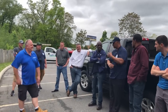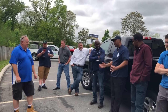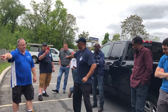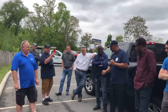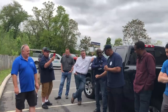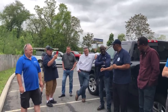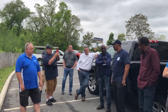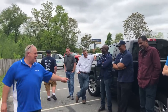I did this one lady, just a small section. Her whole deck, you walk on it, you might as well just slide. Sodium metasilicate. And I just took some of it off with my M5. Took it all off, but then you can see the spots of the mildew. That's where the spore started. And that's really gross. Sodium metasilicate, get it out of here. Just putting you in the commercial.